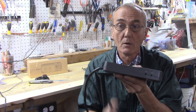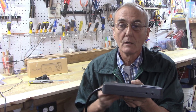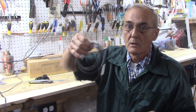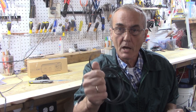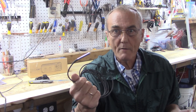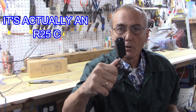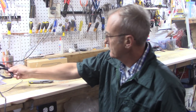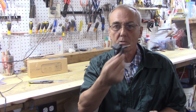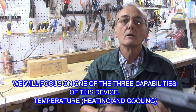On the bottom you've got P1 and P2 — those are for the sensors. P1 is your heating temperature sensor; it's actually a thermistor, an R25C. P2 is your humidity sensor. We're not going to use P2 today because we're going straight with temperature, since we want to control temperature in whatever process you're going to be trying to control.